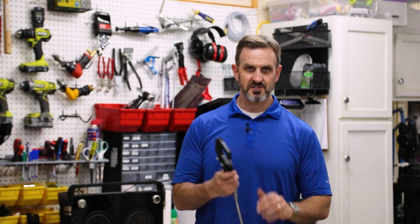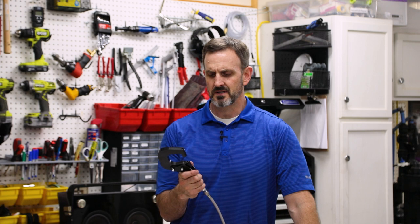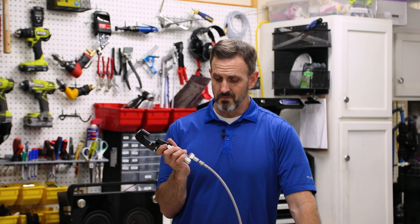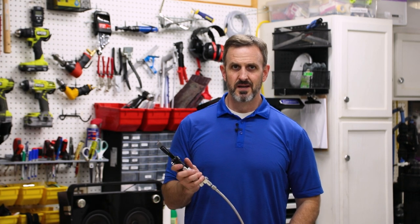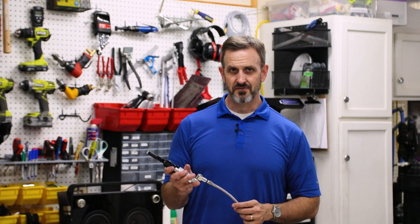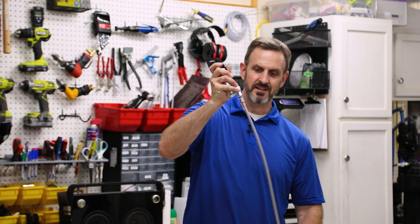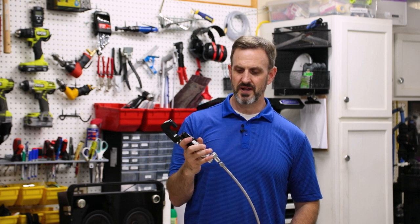some other thoughts in no particular order. I'm using a hydropneumatic squeezer. I think they have some pneumatic squeezers that are a bit bigger. This thing is really finicky. It took me a long time to figure out how to get it to work right. You have to bleed all the air out of these lines. If there's any air in there, it's just not going to work at all. I had to do that several different times. Sometimes overnight, I'd hang it up really high, and I'd use a massager to shake it to kind of get the air up. In any case, it seems to be working really well now.